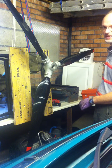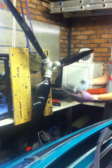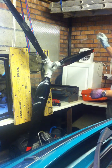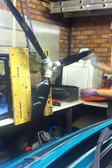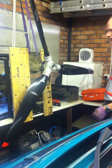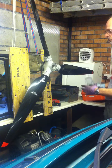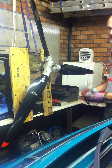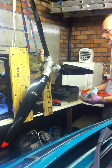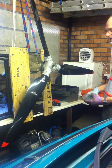Just to show what happens if it is off balance: if I take something fairly light like this piece of plastic, which really has very little mass, and put that onto one of the blades, then rotate it — as you can see it continues rotating. So it's reasonably sensitive. I'm sure there are much better tests; the bearing in the gearbox perhaps isn't the lowest friction method, but it's certainly quick and cheap and allows you to check your static balance.